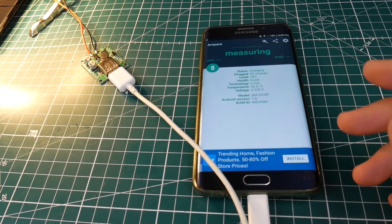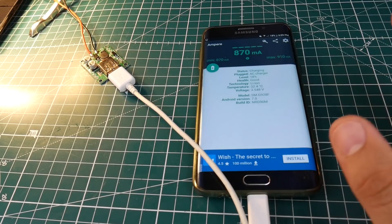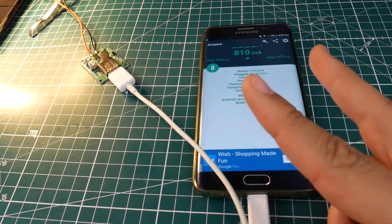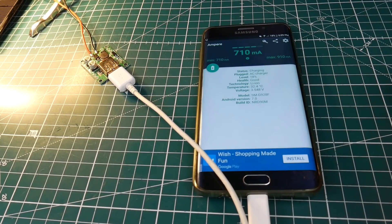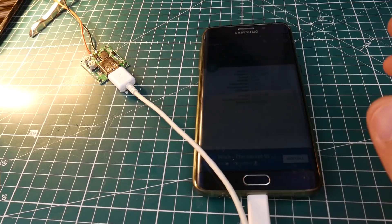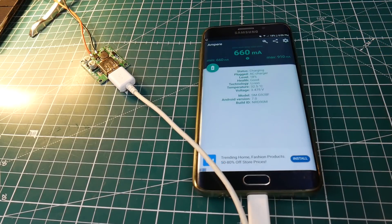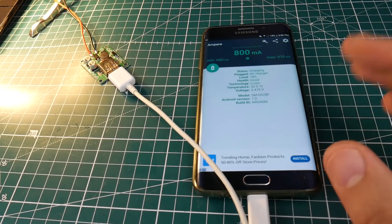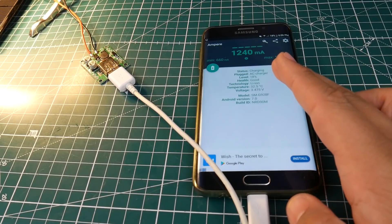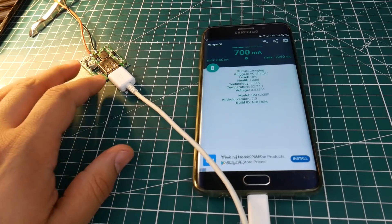It works beautifully in sunlight — just put it by your window and it'll charge anything. I've gotten it to charge at 1.7 amps. Right now under artificial light with two table lamps, it is charging. Devices like the GoPro and Turnigy Evolution charge between 700 milliamps and 1.2 amps, and you can see we're reaching 1 amp... and there's 1.2 amps right there. You just have to find the sweet spot under artificial light. This whole project was a success.